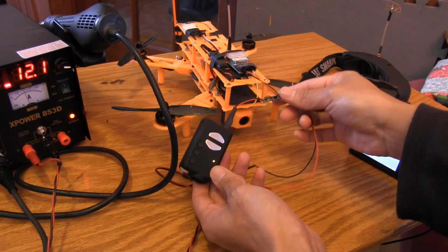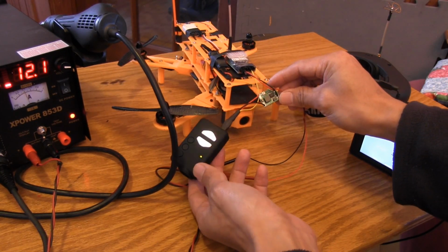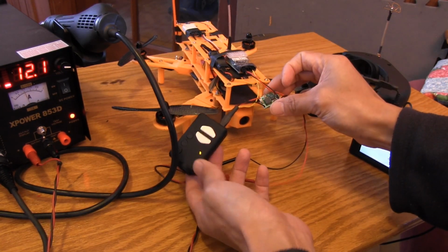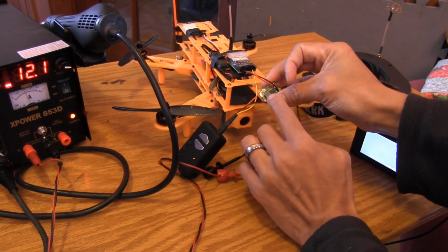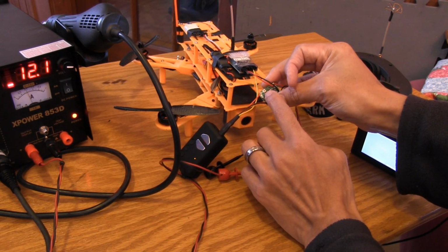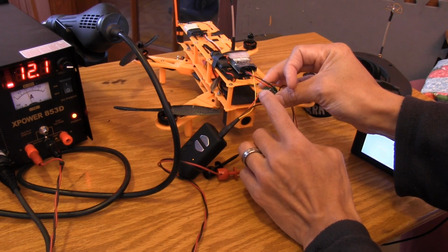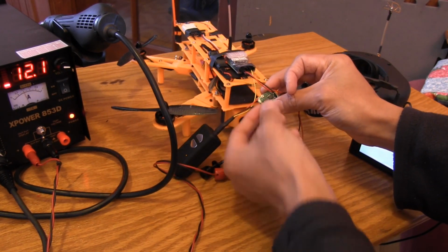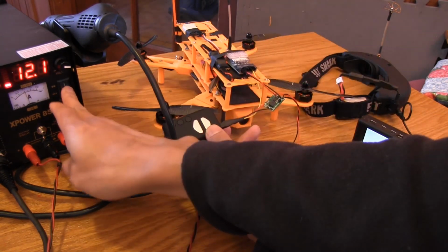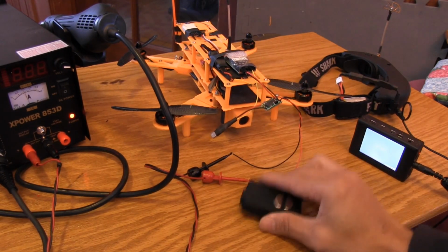Just to finish this up, what you should probably do is either grab some clear heat shrink, or even just regular rubber heat shrink, and toss it right over there and secure it. One other thing that you also should do is get some hot glue and just drop it right on the trim pot, and make sure that doesn't move as you're handling all of the equipment, so suddenly it's not outputting 5.5 volts. Actually, let's shut you off and then pull that out.